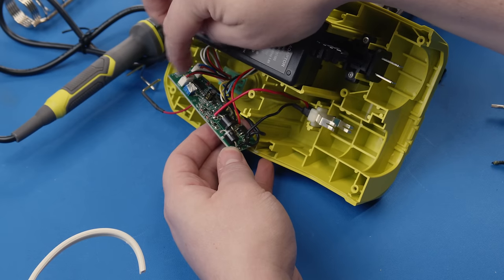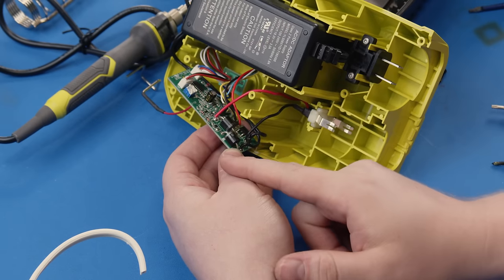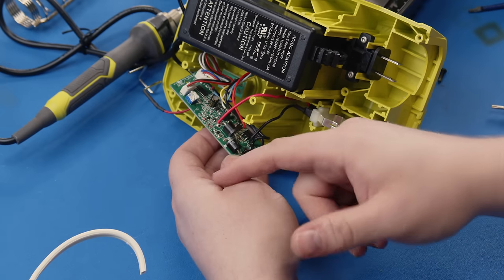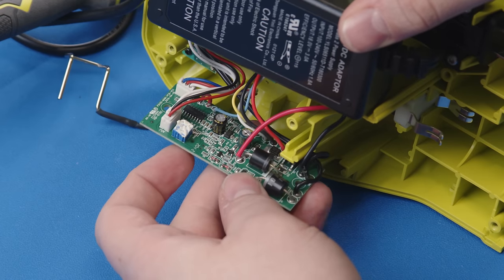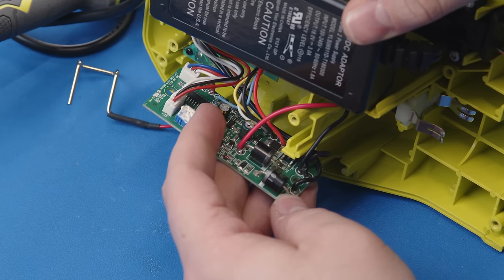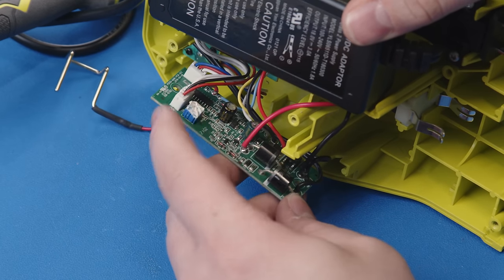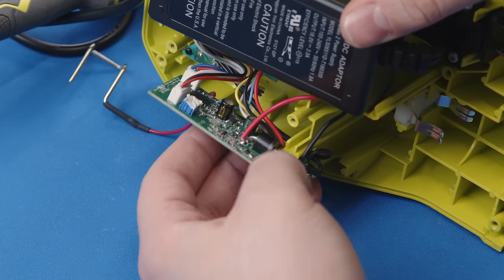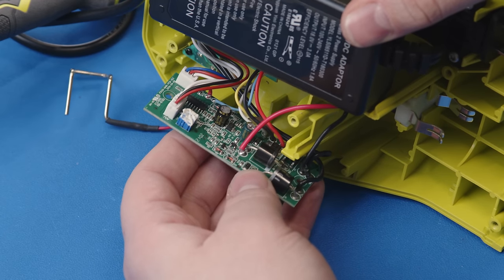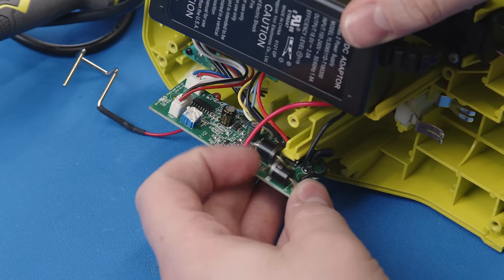They use a couple connectors here and here, but a lot of this stuff is just flying leads soldered right down to the board. So just the act of pulling this out to inspect it, you could snap a solder joint and make the situation worse. This thing looks pretty straightforward. There's a mess of basic transistors on there. They got a microcontroller up here, presumably, that's doing most of the actual work. There's a potentiometer here for presumably calibrating it that's been siliconed in place so you can't change it. And then otherwise, the only thing that stands out are these two big fat diodes here.